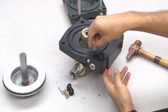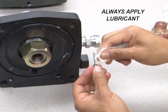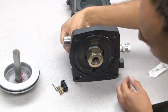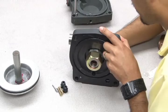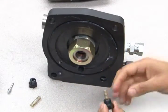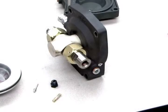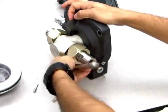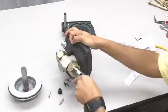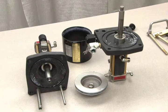Repeat these steps on the inner side of the other end cap. Now take the new pilot stem, apply Haskell lubricant, and insert it into the hole on the outer side of the end cap. Replace the spring onto the plug and screw the plug back into place on the end cap. Tighten down the plug with a socket. Repeat these steps on the outer side of the other end cap as well. This concludes the air drive maintenance procedure.